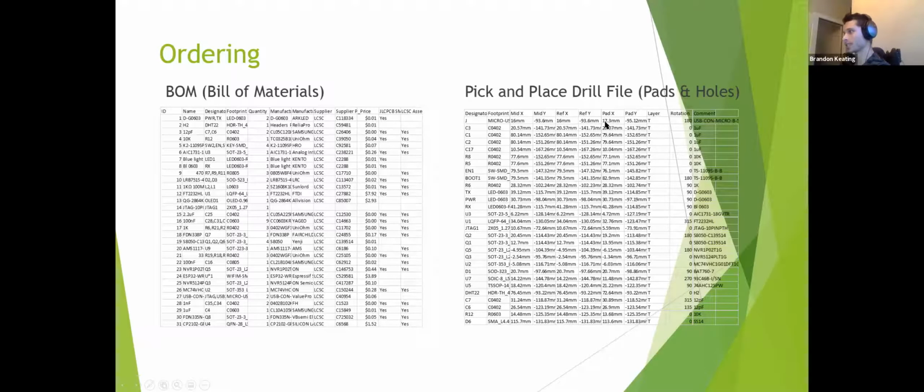The difference here is how big that's going to be. So it's like just over a millimeter. Very, very, very small. But this file will allow them to pretty much just put your design into a machine, put some FR4, which is the plastic material substrate. It's not really plastic, but it's what they use in PCBs. It'll allow them to put that in their machines, and their machine will tool and etch on every single pad exactly the way that the footprints dictate it will go.